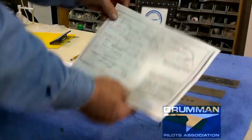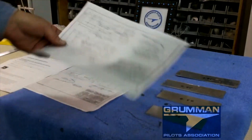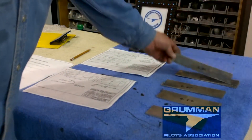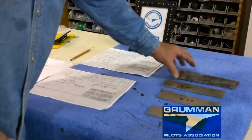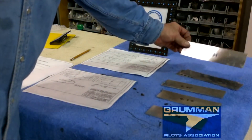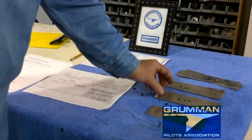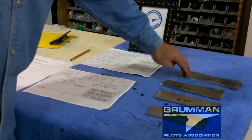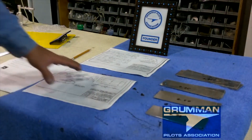Also called out in the paperwork are all the pieces of metal you need. They're two inches tall with some distinctive lengths. We went over to the metal shear this morning since we have a couple of people wanting kits — Rags out in Chandler, Arizona also needs to do a split nose bowl in his shop. We're cutting all the metal and sending all the fasteners: seven and three-quarters, seven and a quarter, six and a half, and five and three-quarters inches. They all call out where they go — left outer, right outer, left center, right center — as called out in the diagram.